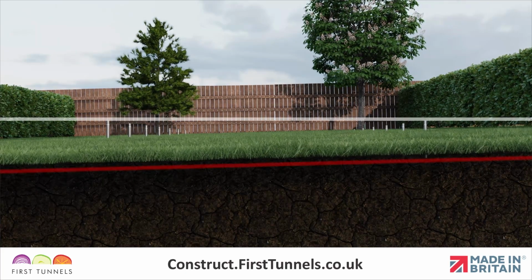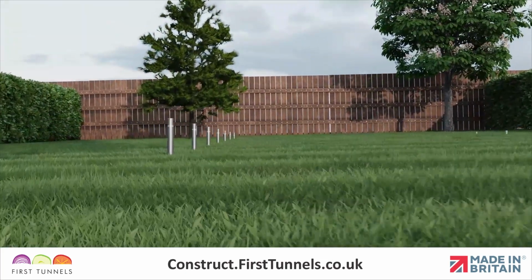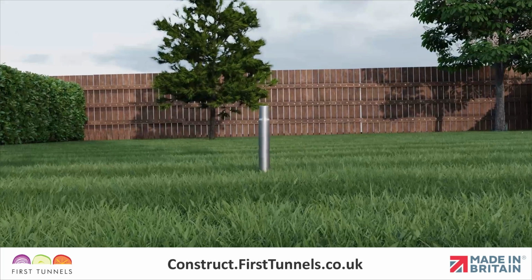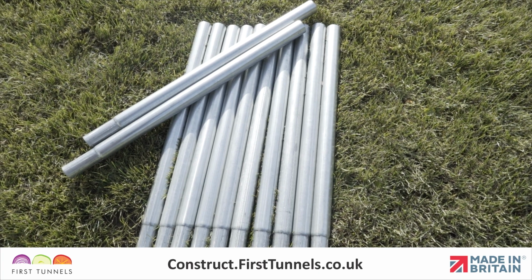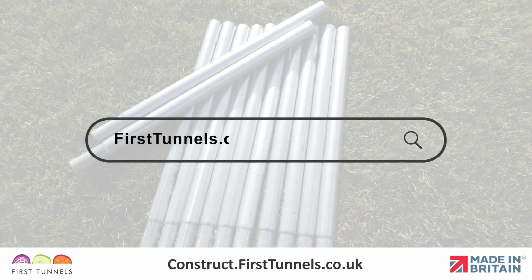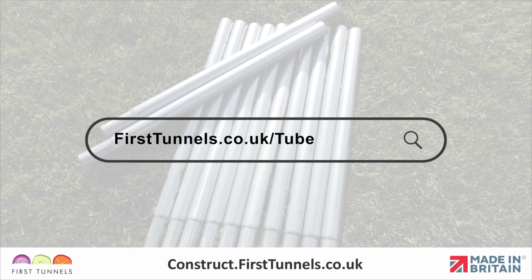A slope along the polytunnel's length is not an issue. However, if the site slopes across the width, then the foundations on the lower side will need raising out of the ground until they are level with the other side. This is to ensure that the hoops are vertical. We suggest that the foundations are raised no more than 15 centimeters, as you require enough foundation to be secured into the ground. We can supply longer foundation tubes if required. Please visit firsttunnels.co.uk/tube.